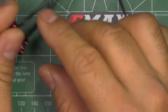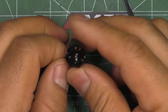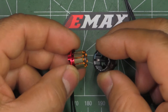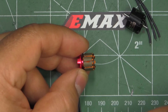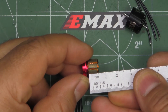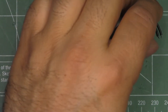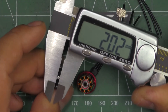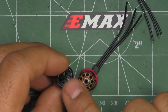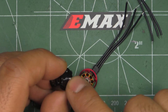It's the usual Emax construction — pretty good quality, everything feels tight. Taking it apart for inspection: the stator measures the nominal 6 millimeters tall, no surprises there. As usual from Emax, pretty neat windings. One thing I noticed is they're using a 2 millimeter motor shaft, which is pretty good. Most motors use 1.5 millimeters, but these are 2 millimeters all the way through, then turned down for the prop.